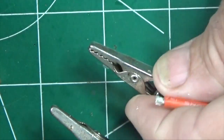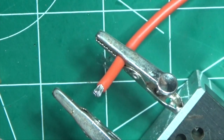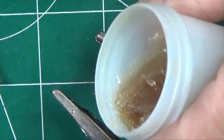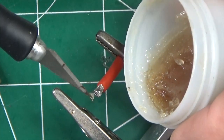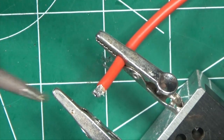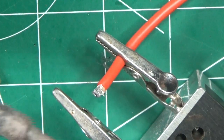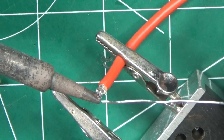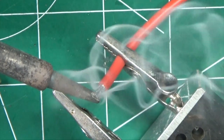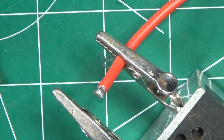Now we want to tin this wire, so we put it in our alligator clip and we want to tin this wire by getting a little bit of our flux and wiping it on the wire. This creates a primer for the wire so the solder will adhere to it quickly. If you don't use flux, you'll struggle getting the solder to stick to the wire. When you use flux, you can tin the iron, shoot the solder right onto it, and look — the wire's tinned very nicely. Poke any sticking-out wire back in — now that's ready to go in the connector.